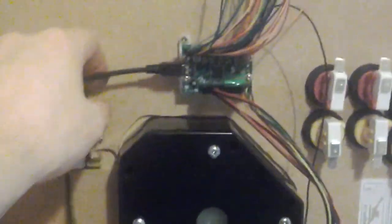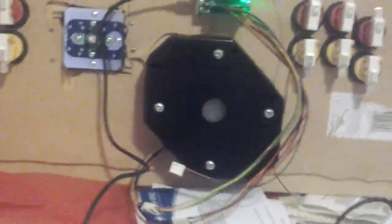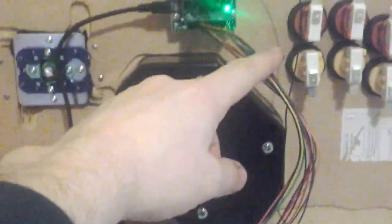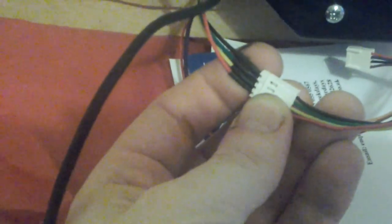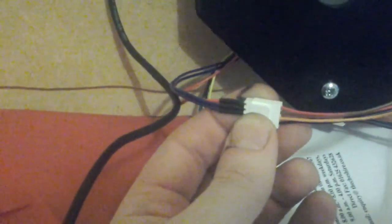And this is the mini pack, and what we've got is the USB lead, and it plugs into the PC. As such, and it switches on, green light. Now this is the mini pack. It comes with, these are the digital side for buttons, this side is optical for trackball and spinner. And if you look, there are 3 cables coming out. One of them is for the spinner, which isn't used, and the other 2 are for the trackball. So on this side, if you notice, we wire up and match the black, green, yellow and red with the same. Now on this side, excuse me, they've got the colours slightly wrong, so we have to match up the orange and brown and red and black with the purple and red and blue one.